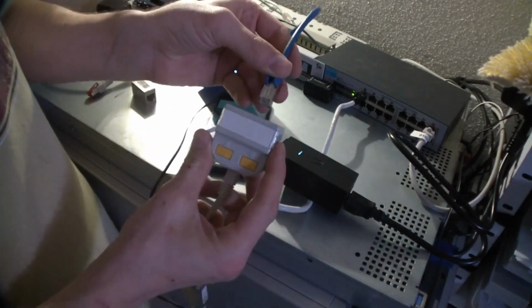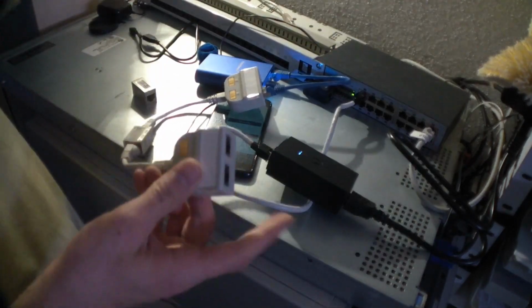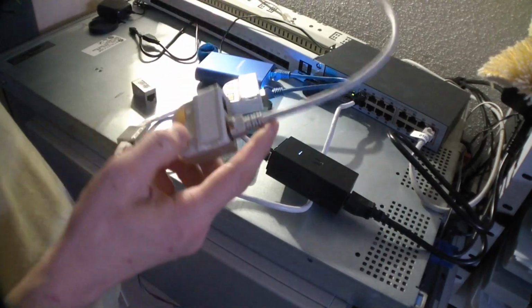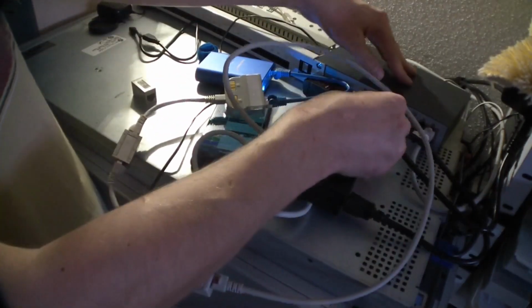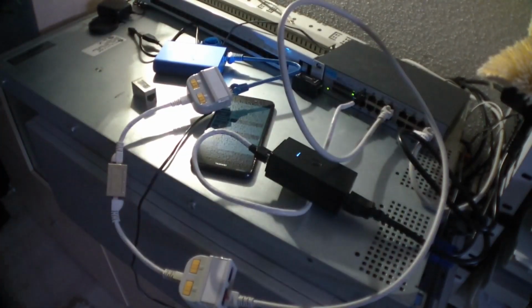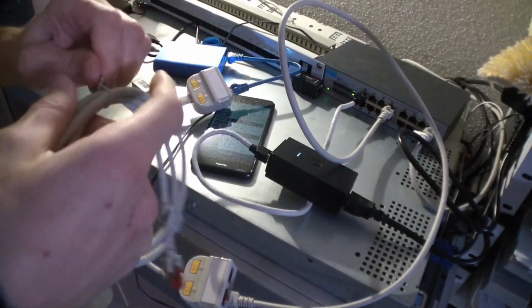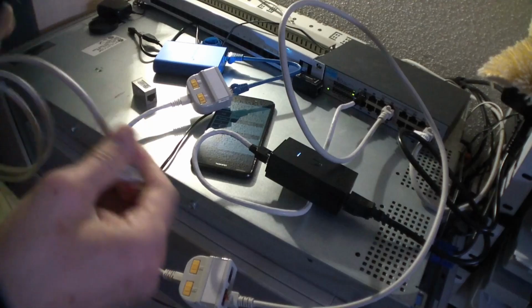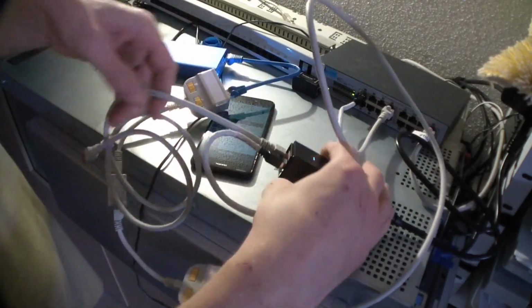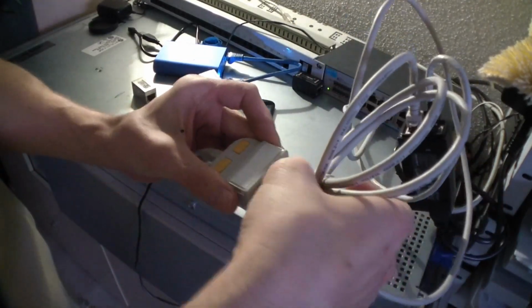That section is my office. Let's say A is my computer, whatever. And of course you have to connect A on the other side as well. So A goes into my full gigabit switch, right? And B goes into a power over Ethernet, for example, for a phone. Some VoIP phones do that. So B goes into that.